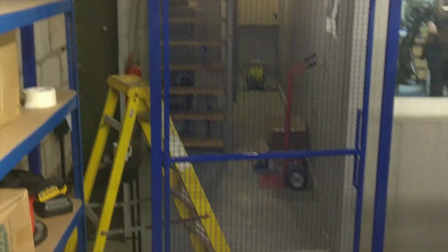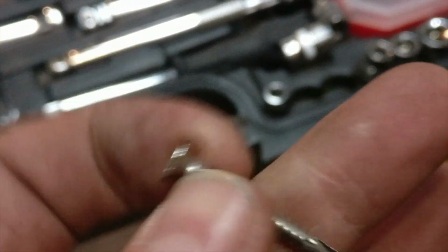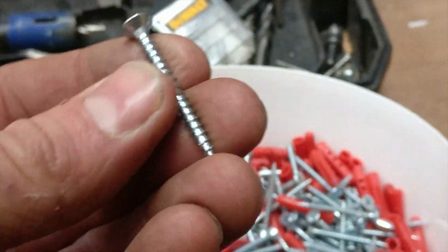I think it was pretty good. Oh, got one load of sheeting on. It's a lot stronger than I thought it would be, given that there's no pieces at the bottom or in the centre. But it is steel, so I got these screws. I thought I'd save myself some time, so they're posi focus, self-tapping, self-drilling. They don't work. They're stainless steel, so they just break in half. So I found these little bad boys upstairs, just normal fasteners, and not a single one broke. They drilled in there real nice. It's solid. It's really good.